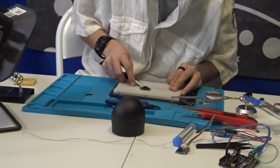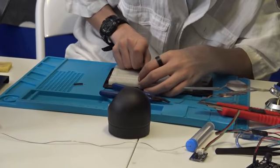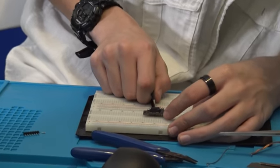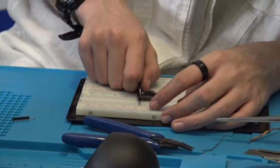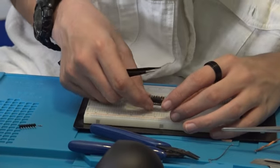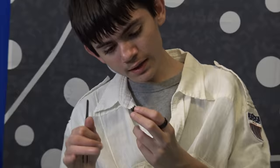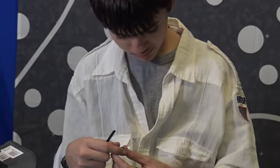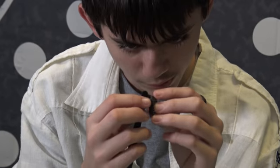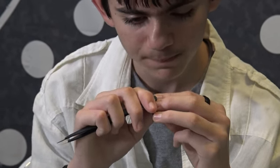So I finished soldering, and now I take the board out. You want to do this very carefully, because the solder points might be a bit weak, since of course you just did them. And meanwhile, while I'm taking this out carefully, I'll explain some of the ways to tell if it's a perfect solder. So, it's a perfect solder when it meets up directly with the wire. Like you could set something flat on it, and it'll line up perfectly with one that has not been done.